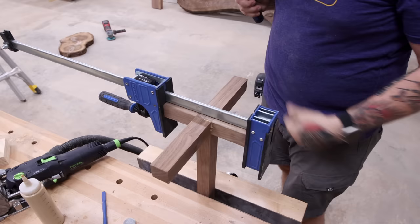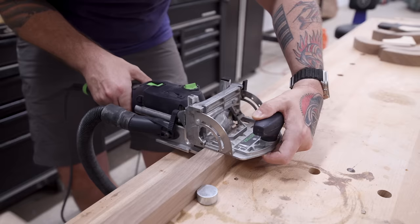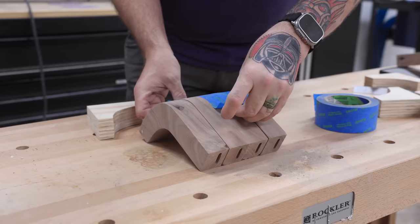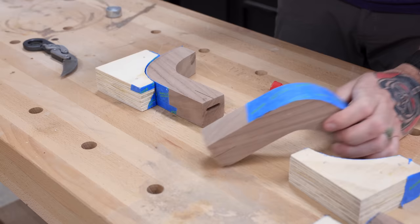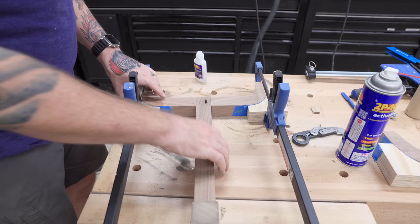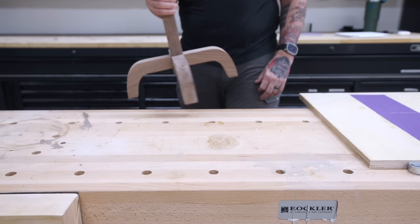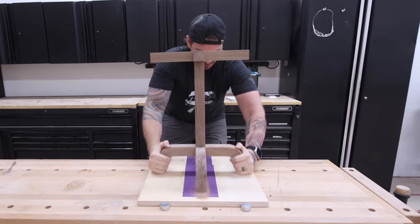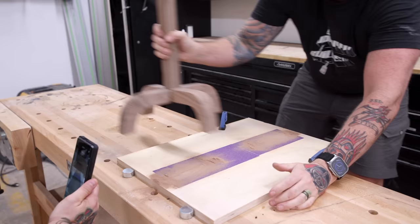Hopping off the soapbox — let's talk about the table base, which I don't think was a failure. It's a nice little walnut table base for this little side table. I'm going to assemble the whole thing with domino mortises and glue. For the curved leg glue-up, I made some little curved clamping blocks that match the outside radius of the legs, giving me a parallel surface to clamp. Jeff had a good solution — clamping the blocks vertically first to hold them from sliding up and then clamping horizontally to glue the legs to the center column. The next day the base was a bit wobbly, but you can quickly sand the high spots down with sandpaper glued to a scrap piece of plywood.